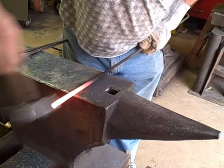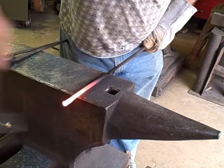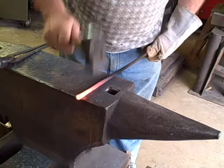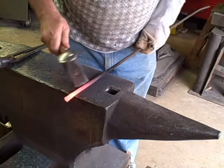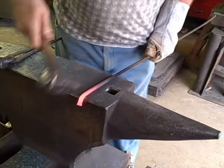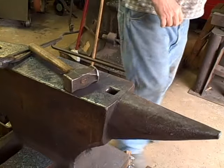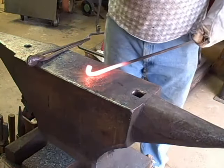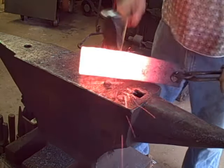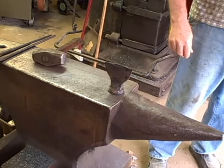We're going to be using a mandrel inside the gun barrel when we're forge welding. The flat bar is going to be rolled into a pipe and forge welded along a seam. This mandrel will be inside so that the pipe — the barrel — does not collapse while we're forging it. This is a relatively high carbon piece of steel. I put a taper on one side because I'm going to push it into the barrel as I'm forge welding it, and I need to be able to pound it out to extract it.